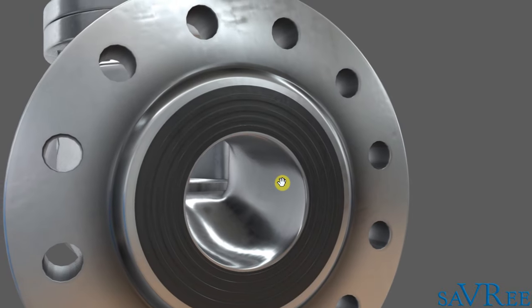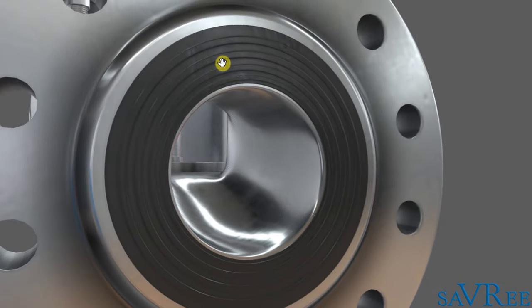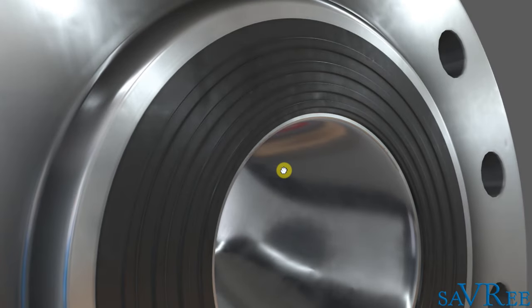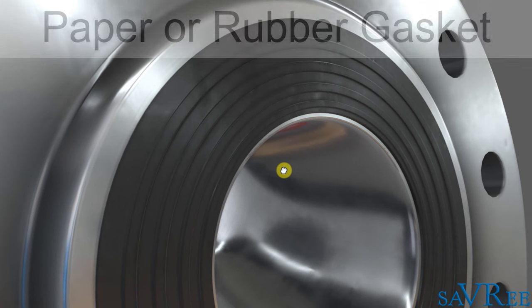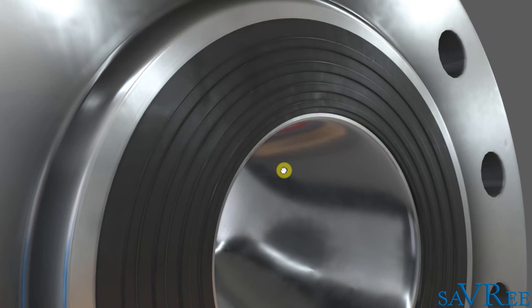Each of the flanges also has a sealing arrangement, which allows us to seal the valve to the pipework. This sealing arrangement is the black highlighted area with a ridged profile — the ridges help it to seal. Typically, we use a paper gasket or maybe a nitrile rubber gasket, which helps seal the valve to the pipework when the nuts and bolts are clamped together. The reason for the gasket is that if you try to clamp two hard metal surfaces together, they don't seal well — there's always some sort of gap. The soft rubber or paper gasket is squeezed between the two metal surfaces to form the seal.